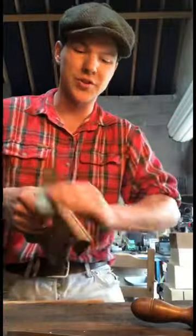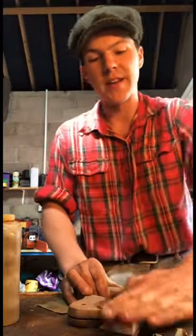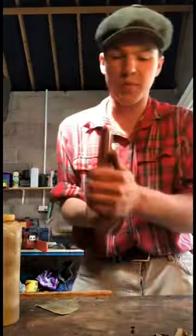Last thing I'm going to do is just spruce up the handles a bit with sandpaper. It's not necessary, but I think it might make it look a bit nicer in the end. So we have it sanded there now, so it's going to get a drop of linseed oil and rub it in. And that kind of makes the grain pop out a bit more.